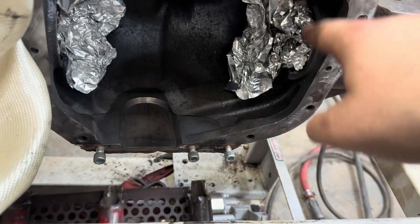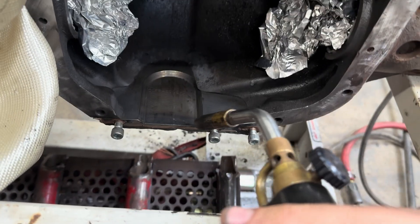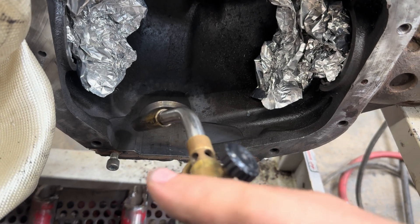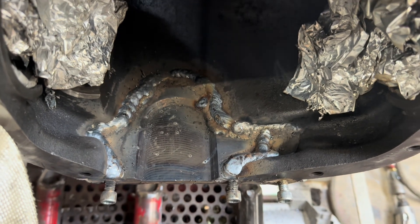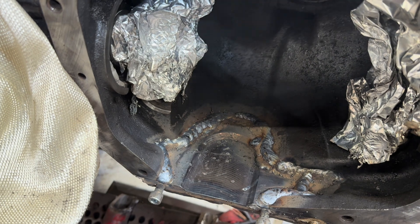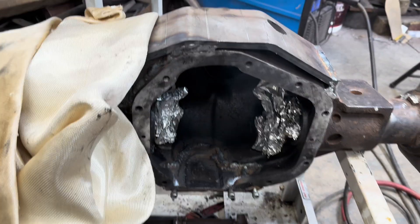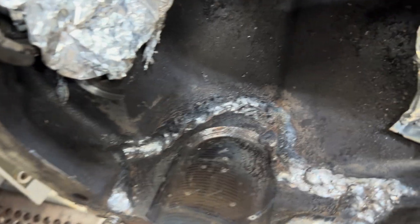The inside's welded. I'm about to go over it with the needler — it's not the prettiest thing in the world, it honestly may not be pretty at all, but I'm going to go over it with the needler and I think it's on there pretty well. It should hold. I'll clean it up with the needler, reheat it, and then we're going to wrap it in welding blankets. I'll leave the tin foil in there too — might as well keep a little bit of heat in. Looks all better needle scaled. We did the inside — weld that up, got the salamander, and now we've got a turkey fryer.